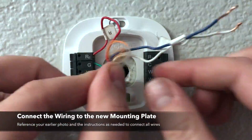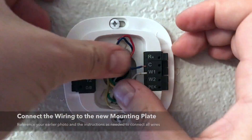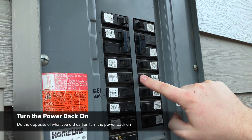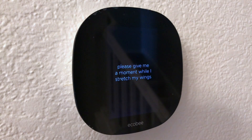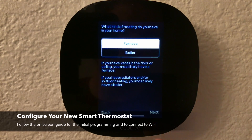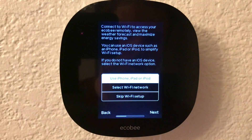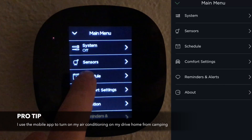Then it's just a matter of reinstalling all the wiring into the correct places — you can refer to the instruction manual but it should be pretty straightforward. Now it's time to do everything in reverse order. Flick that switch back on, or if you didn't have that, turn the breaker back on. Once you've got that sorted, the Ecobee will come to life — or whatever smart thermostat you've chosen — and you'll need to go through the initialization process. This took about 10 minutes for me but the whole process was really intuitive and went really easily.